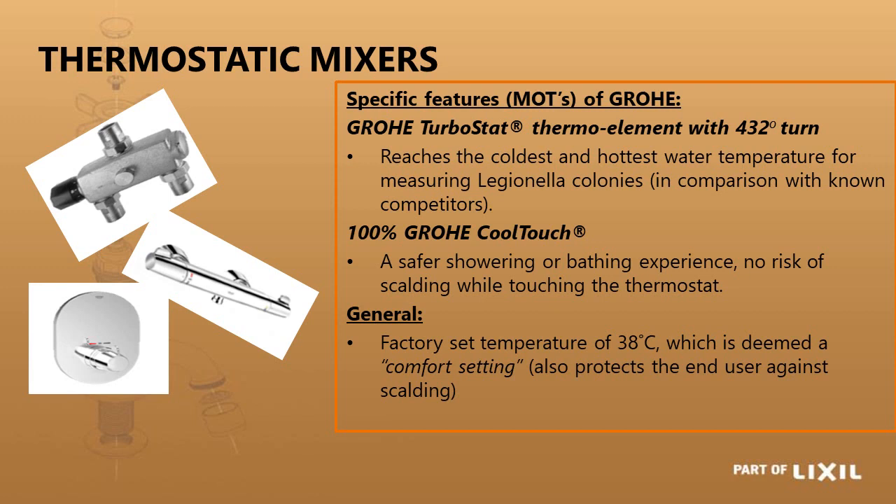The top industrial mixer model is normally plumbed out of the way where the user will not see it. You can also lock it using lock rings inside, fixing it to whatever temperature you require — it is then not user-adjustable and is preset to your specification.